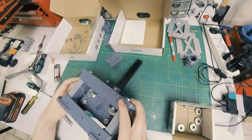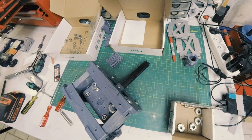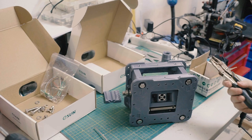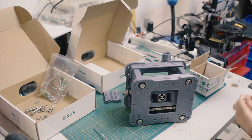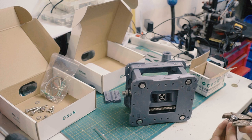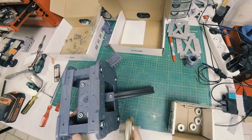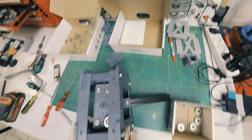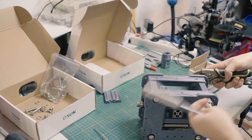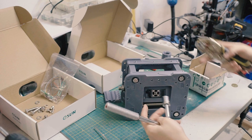Okay, so to do this, this is actually a little bit annoying in that I kind of have to clamp one side, actually. If I grab my, this guy, and this is a dirty little trick, but you could get a screwdriver or something in there, but I'm using another socket head. Stick that there, stick it on one side of the nut, and then kind of, now you're gonna wanna do it until it starts really creaking. Yeah. That's good, and then opposite corners. Always do opposite corners so that the forces, like it doesn't distort unequally.